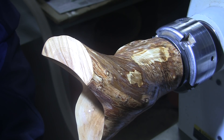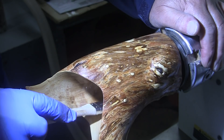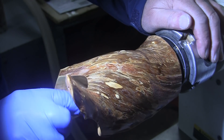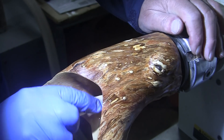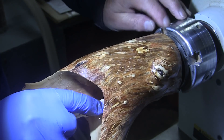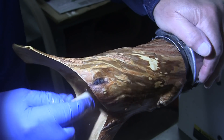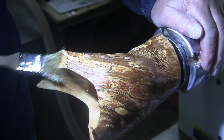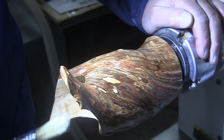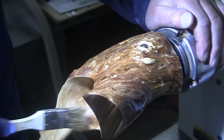I'm brushing inside the opening now. What I did for the inside is I took a half-inch dowel with a split cut in the end of it, doubled over some sandpaper strips, mounted that dowel up in my drill, and just let the sandpaper hang out a couple inches. It did a fantastic job in there — I was pretty amazed at that. So all in all I'm pretty dang happy with this piece. I still have to figure out how I'm going to mount it to take off the tenon, but that's going to be tomorrow.